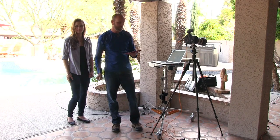They're already coming in. So the first one is, can you use this B1 with the D1 together? So yeah, the B1 has a battery built into the side. The D1 is actually something you have to plug into either a wall outlet, or you can use a portable power pack to power on location. You can use them together, absolutely. The difference though is the D1 doesn't have through the lens metering. It doesn't have TTL metering, and so you have to do everything manually. With the B1, it's got built-in metering. You can use it, and you don't need a light meter. The camera can control it. So you can use them together, but they both have to be used in full manual mode when you do that. Or you can use the B1 in TTL mode, but you have to control the D1 in manual mode to control the exposure of that. So yeah, you absolutely can.